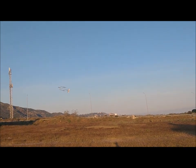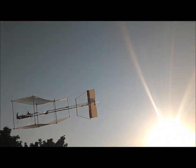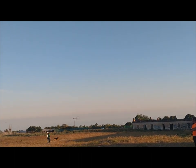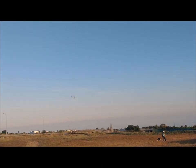This second version was able to fly, but the plane still shows some problems. As we have shortened the tail of the aircraft, the turning moment for the yaw is insufficient. Keep in mind that these aircraft are designed to fly at very low speeds, so the rudders must be oversized given the low air force on them.